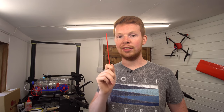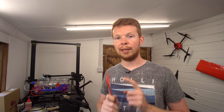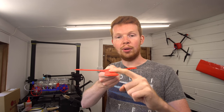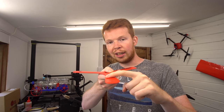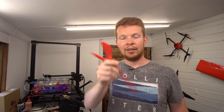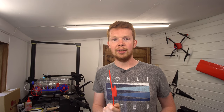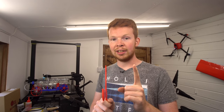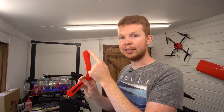Now this information is really useful because it's essentially how the boomerang curves in flight and comes back to the thrower. Each blade of the boomerang is shaped like an aerofoil on a wing on an aeroplane. There is a really sharp curve at the front and a really shallow curve at the rear. And when air is flowing over this, it produces lift. Now because when you throw a boomerang, you throw it in the vertical direction, it's producing lift horizontally in this direction.